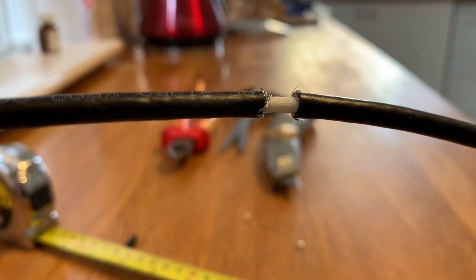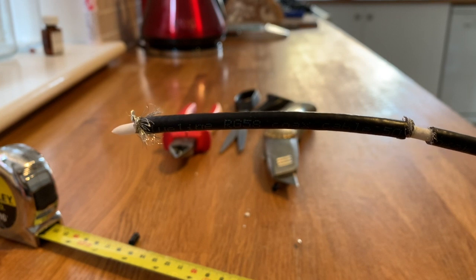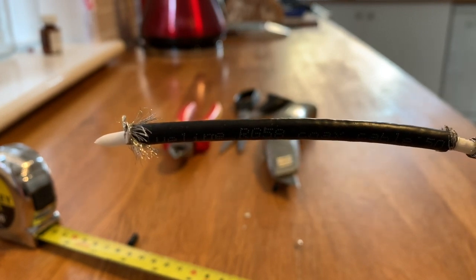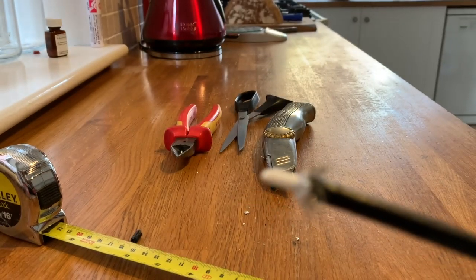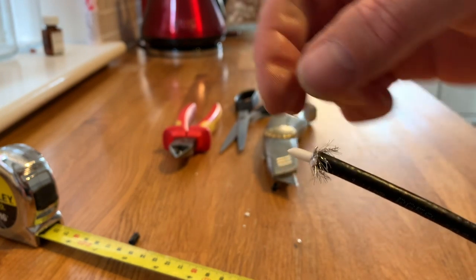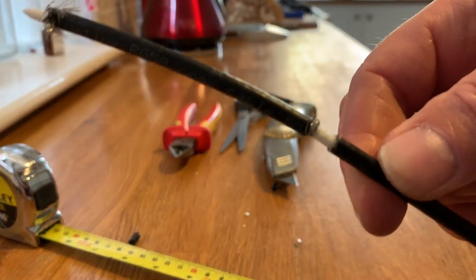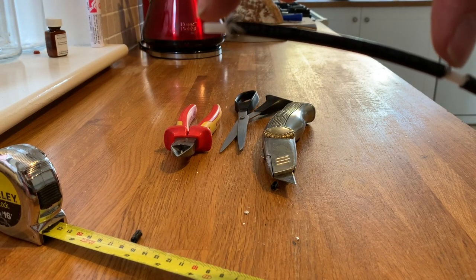And that's about an 8mm gap. Then we shall have 8.6 centimeters or 86 millimeters of coax shield, and then we're going to solder the driven element to the shield here and cut the center off. Okay, and then that will be the main driven element. This is the capacitor of 86 pF.